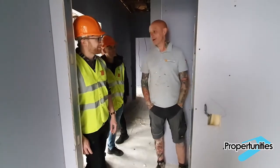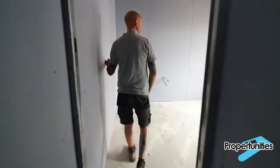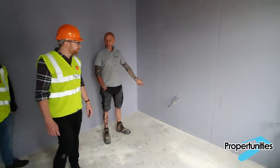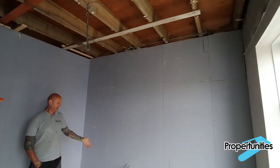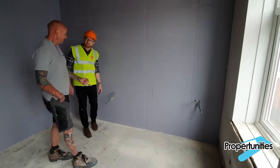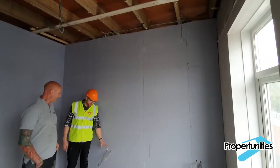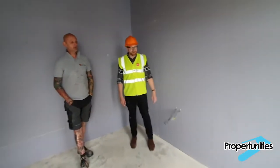Having electric heating rather than gas. And then moving this way, this is the lighting of the bedroom. We'll set this out to take a fixed headboard. We'll bring power through into the headboard. We'll put some drops, some lighting over the bed or the bedside. So when you say fixed, the headboard is attached to the wall? Yeah, attached to the wall. The power will come through into the headboard, and the lights will be switched from the headboard as well as the wall. So in theory, these will be above bedside table level, so it's convenient to get to. That's right. Cool.